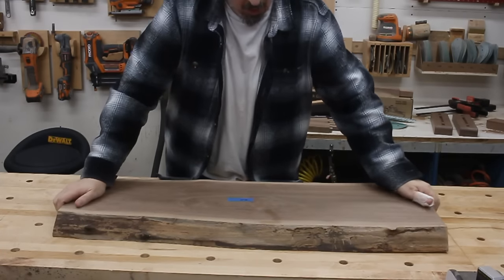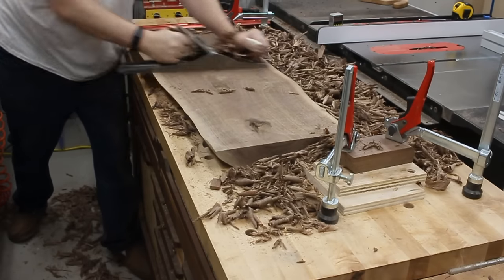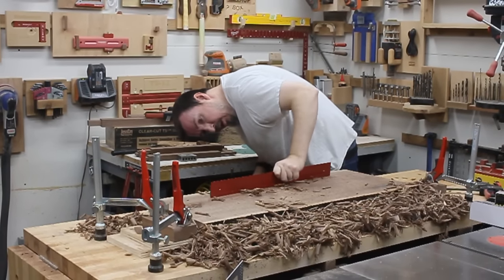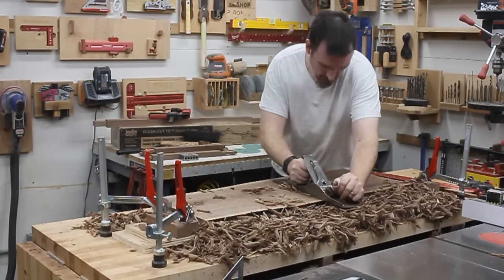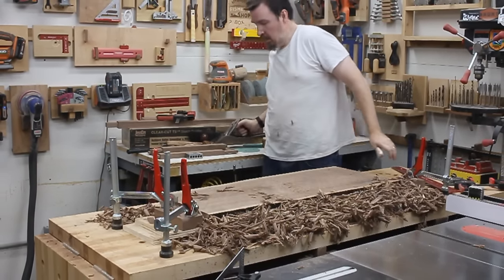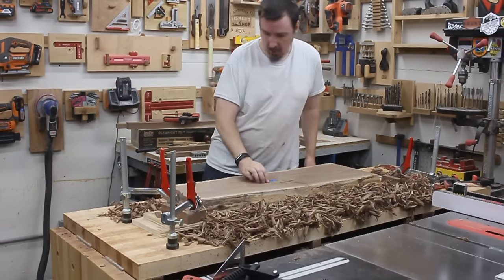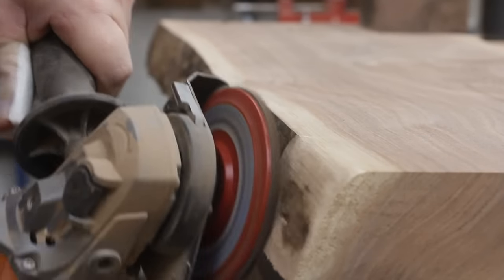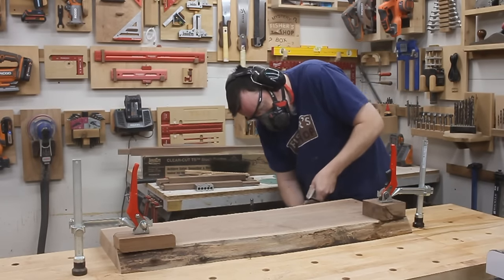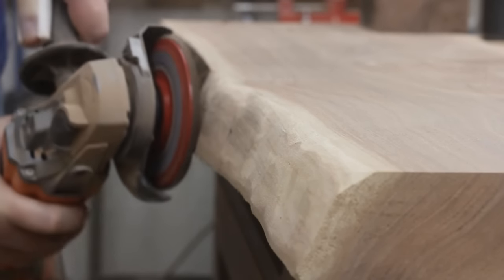When I went to work on the benchtop, I noticed the bottom wasn't perfectly flat. Since I thoroughly enjoy punishing myself with physically exhausting tasks, I decided to fix it by using a hand plane. The slab was just too wide to fit through my planer and too long for my CNC, so this was my only option. On the bright side, my arms were too weak to even lift a can of soda the next day, so I actually made some healthy choices. In the end, I got it perfect. Then I put a flap disc sander onto my angle grinder and ground through the rough exterior of the slab edges to uncover the sapwood underneath. I shaped the edges a bit, gave them a really soft appearance, and rounded all the edges over.